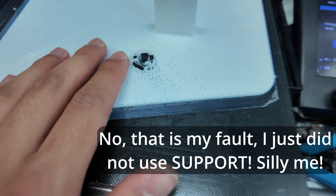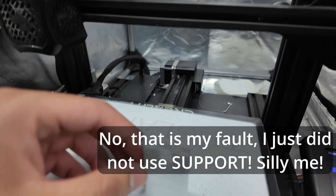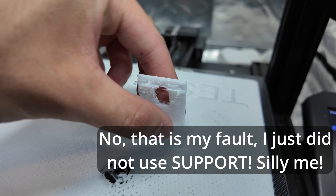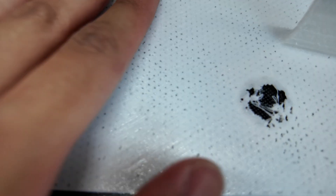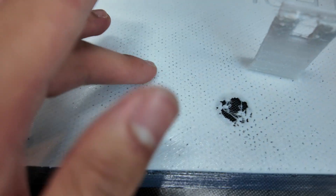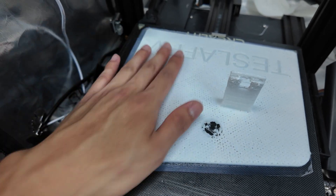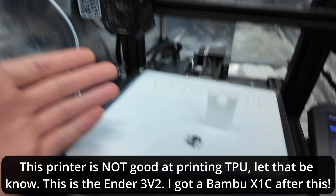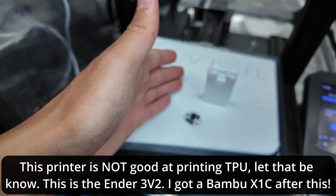First print done. It's so thin that it wasn't able to print this hole very well — it might need to be a little thicker at the base area. The speckles are there because it's so thin and I only used about 30 to 40% infill. If you're going to make it this thin it needs to be 100% infill, or use a better printer. Anyway, I'm going to use this as a prototype, put it on the car and see how it looks.